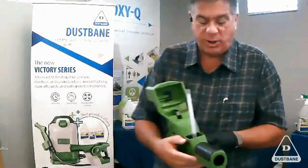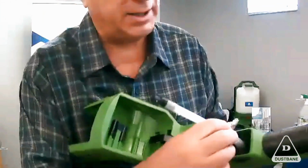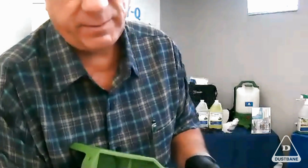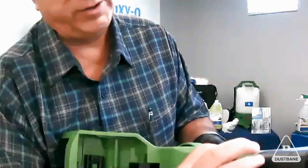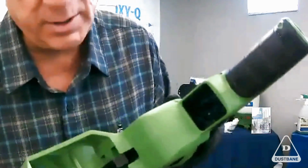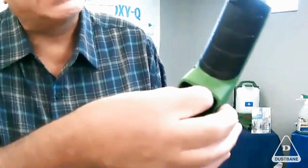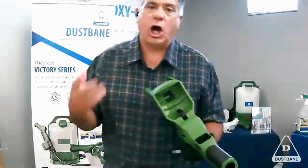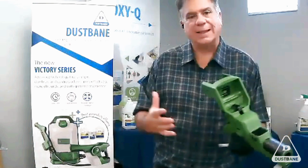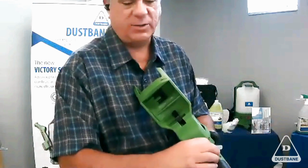And the thing I want to mention, and this is troubleshooting 101. I'm going to try to show you. Let me show you. There's a little plastic piece here, right? And if you can press it, right? So I'm going to try to get closer to the camera. It's right there. And you can squeeze this. If this ever gets clogged or blocked, it will prevent the tank from breathing. So your tank will collapse. So you remove the tank, you just press that grommet, that plastic grommet inside.